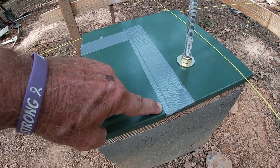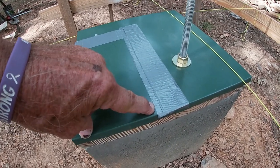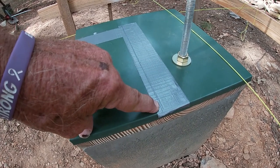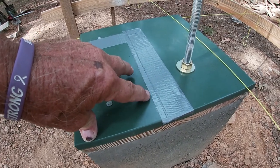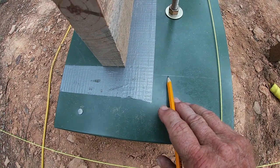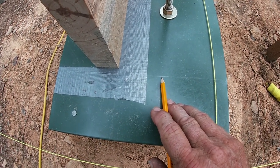And then I came another three-eighths of an inch. Now where my finger is is where the floor framing will start. I'm leaving myself three-eighths of an inch between the floor and the actual inside face of the log, which will allow any moisture or rain to go on through and not be trapped there. There's a line here that's the inside face of D wall, and B wall will also be the same.